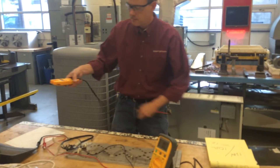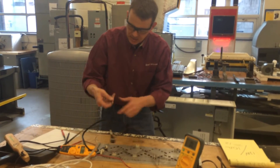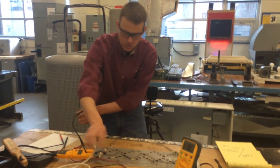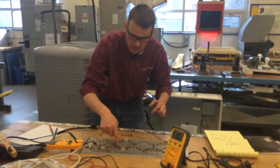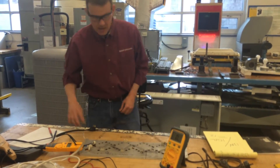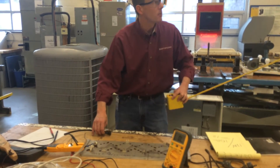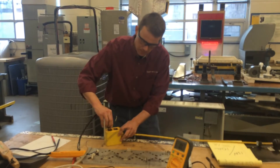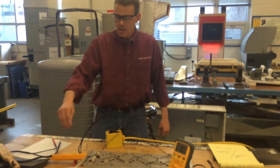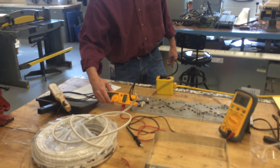To confirm that with the meter, I set it to amps, clip the clamp around one and only one wire, make sure nothing else is interfering with the circuit, and make sure the coil isn't touching any metal — that's why you see the ceramic pieces holding it up. I plug it in, and the amp reading is 12 amps. Ohm's Law works for this resistive load.